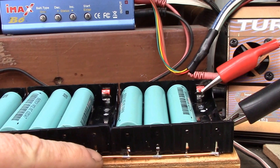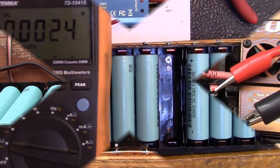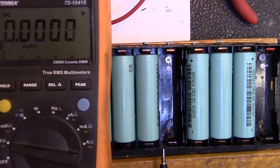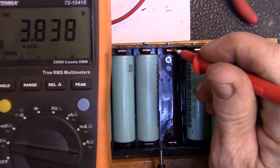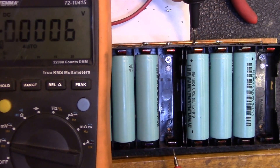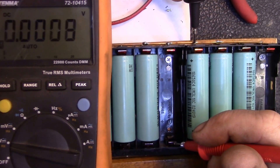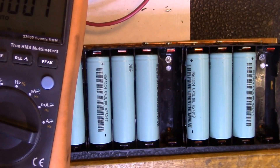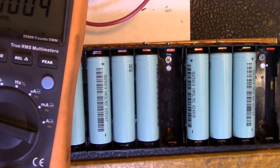Back on the workbench, I want to figure out which connection is bad. I hook up my negative down there and that checks out okay, but that other connection is bad. I'm measuring on the bus wire and I've got a good connection, but if I measure on the terminal itself — nothing. There's my bad connection. I think it broke when I screwed things down. That solid copper wire popped up — it's got a bit of a curve to it — so I may need to reheat the two joints on either side to get them down.